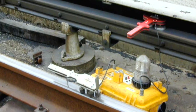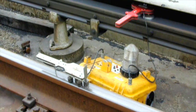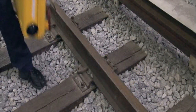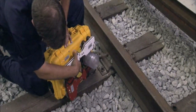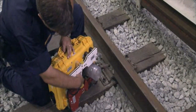A WSAD, or Warning Strobe and Alarm Device, is a safety device used to alert workers and first responders to the presence of traction power along the third rail. The first step in using the WSAD is to test the siren and strobe alert systems. The siren will sound at a level of 50 volts, and the strobe will flash if the power reaches 450 volts.